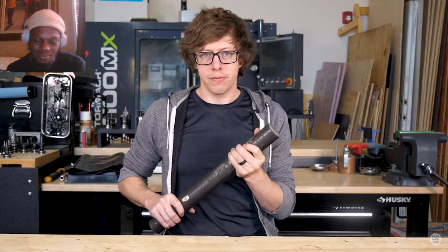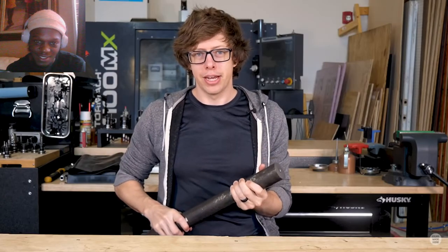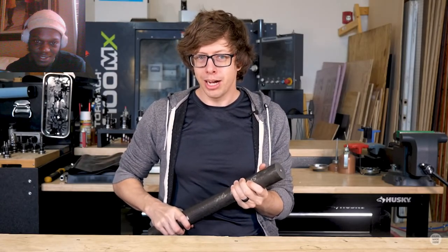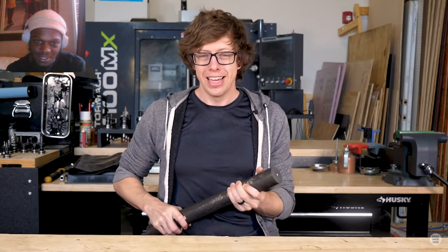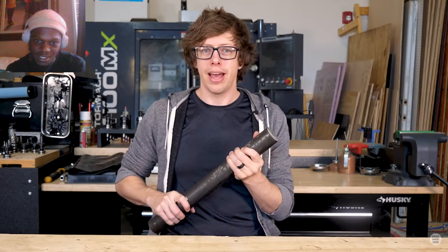This tube lets me solve another big problem, which is stopping the piston. It's going to be a chunk of 2-inch steel, and if I fire the nutcracker with nothing in it, it's going to be going up to 200 miles per hour. If it slams into a solid steel wall at that speed, it will destroy everything.